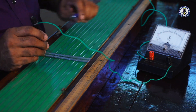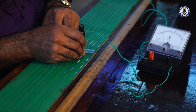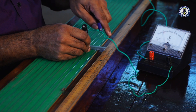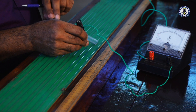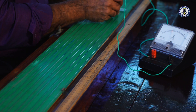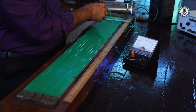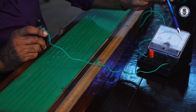We repeat to get a voltmeter reading of 0.2 volts. Moving along the potentiometer wire, the balance length obtained is 140, so 0.2 volts is balanced at 140 centimeters. The experiment is repeated again to get 0.3 volts — the balance length is 220 centimeters. Similarly, balance lengths are found for 0.4, 0.5, 0.6, 0.8, and 0.9 volts. Each time the balance length is determined.